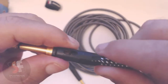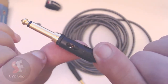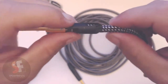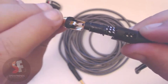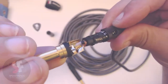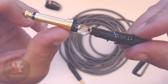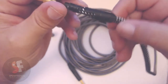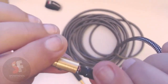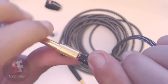Then we have a little flexible insulator here for the other side. We've got our solder joints down in there — let's pull this back — you can see we have very nice solder joints. We have another insulator right there, and you can see the shielding goes all the way around. If I am correct, I believe the shaft goes all the way through the post. There's not really a crimp on this — some of these would just be a thin shield with a crimp that goes onto the cord.